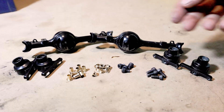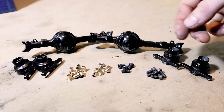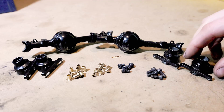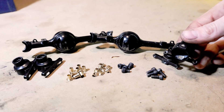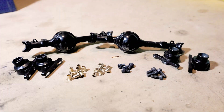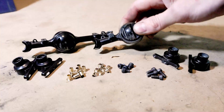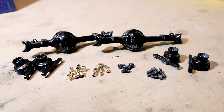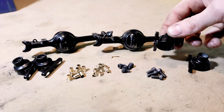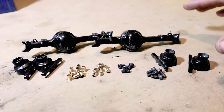We are back inside. I've got my lovely bushings cleaned up — I love them, they're nice and shiny and pretty. I've got my short screws and long screws cut to length. I did have to grind the insides of some of the knuckles to get the bushings to sit flat, because the flange on them is much bigger in diameter than the stock ones. I also had to file down the axle housings just a tiny bit because I made these to such precise tolerances that they were actually a little bit too tight — almost a press fit — which is great for most things, but not here because we need our steering to be nice and free. I'm going to get these partially assembled; I'm not going to put the axle shafts in because there's still some shimming I want to do.